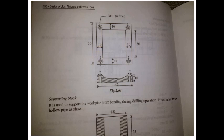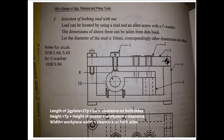Going back to the diagram: the form locator will be screwed and held rigidly by tightening it on the bottom portion of the jig plate. The form locator is not only going to carry the workpiece — the form locator itself will be attached and screwed exactly on the bottom portion of the jig body, using 4 screws.